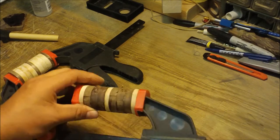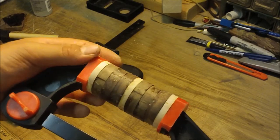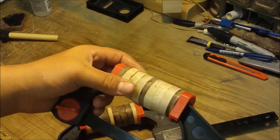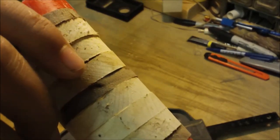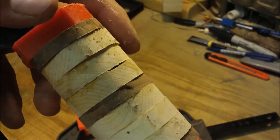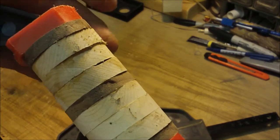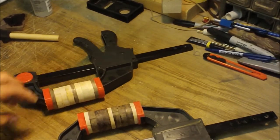Here are the two pieces clamped up — I just put them between the two clamps there and lined them up the best I could. I'll be able to sand if it's not perfectly glued together. On this one piece of maple, the edge of the wood has a mark from a planer where it took some out, and I had to use that piece because I didn't have any more. I'll be able to fill that crack with some maple sawdust after this glue-up to see what it looks like.